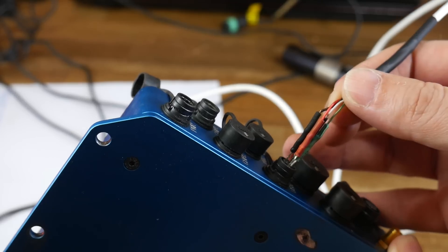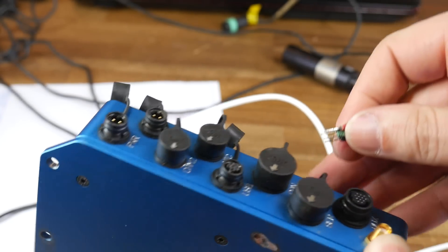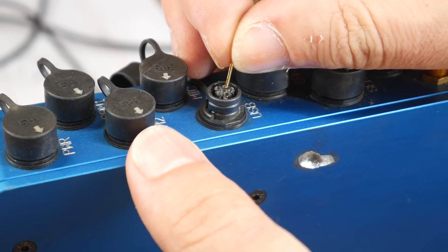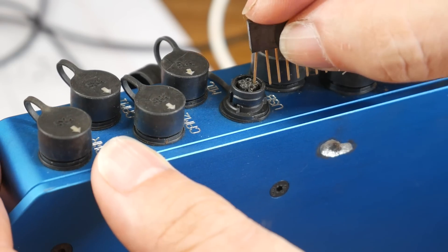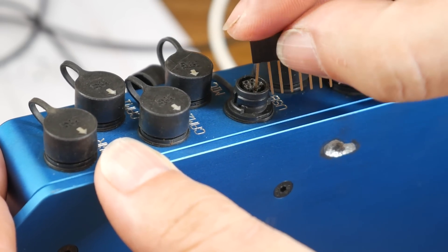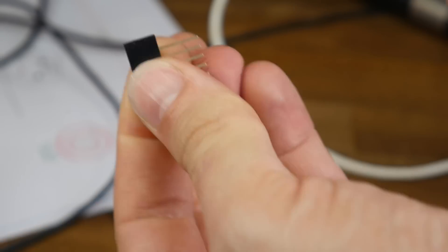That truly was janky but it served its purpose and paved the way for the proper solution. Those crushed DuPont pins are way too tight and feel like they want to bend when plugged in or get stuck when pulled out. So the first thing to do was find something that fits better. I tried a regular PCB header pin — way too wide. I went to my local electronics store and bought the smallest standalone pin they had — again, way too large. But then I tried a stackable header pin, which had a pretty standard width but was narrower in one direction, and it was able to fit into each of the holes without feeling like it was about to explode. This was definitely not perfect but good enough for a cable that will see occasional use, and it's quite simple to remove these pins from the plastic connector housing.